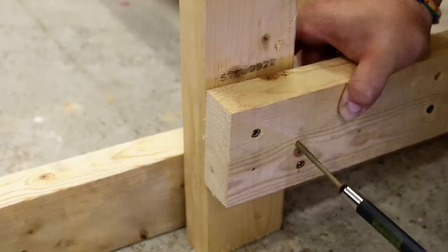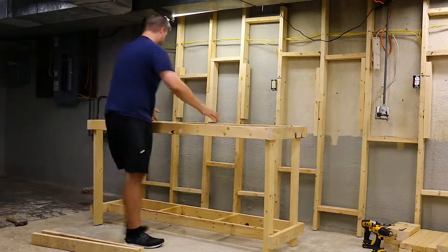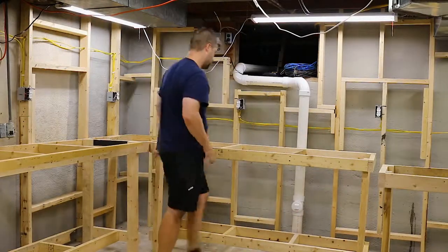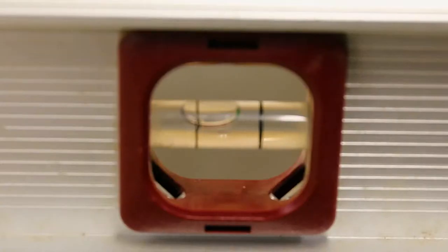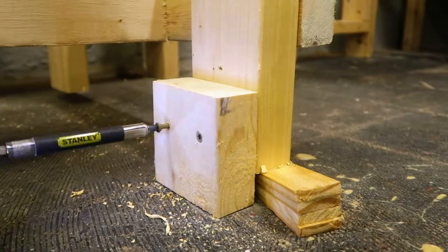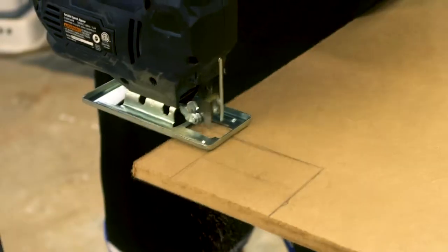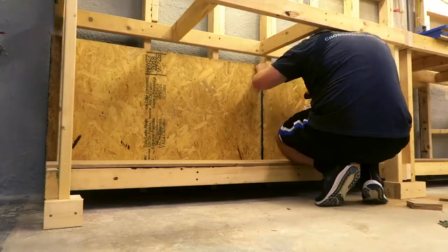What took more time was attaching them all equally level to the wall framing and making adjustments for plumbing pipes. Our basement floor isn't level, but some of that is because it's a basement floor, so everything slopes towards the floor drain. Some of the table legs were nowhere near touching the ground, so for those I temporarily used shims and attached 2x4s on the sides for additional support. Since the bottom shelves were ready to go, I had MDF cut to size at the local home center, made a few small modifications at home, and then installed them along with some inexpensive plywood as backing boards.